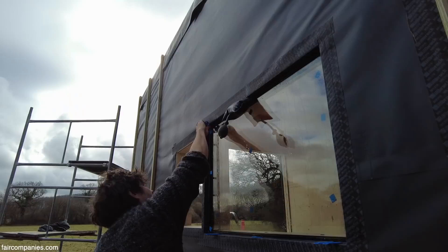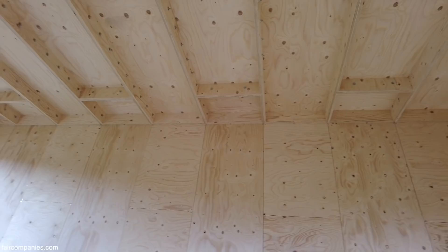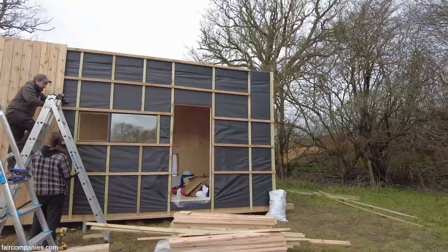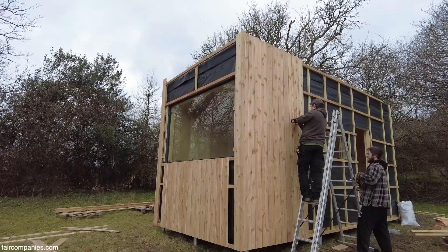I usually go over with shims — they're normal smoothing tools, but the shim actually works quite well, and the brilliant thing is that you've always got them. The U-Build boxes are really the structural frame of the building, so if you leave them on their own outside, they'll get wet. The way we deal with that is after the boxes are filled with insulation, they're wrapped with a breather membrane, and then we use a system of cladding on top of that.